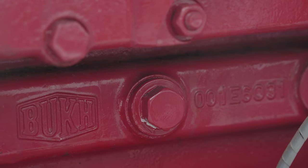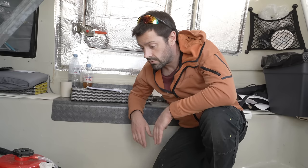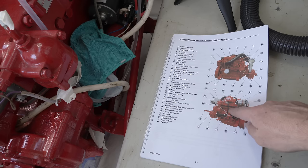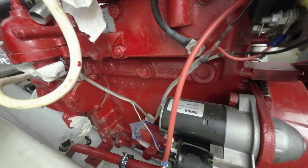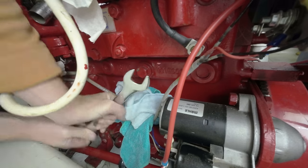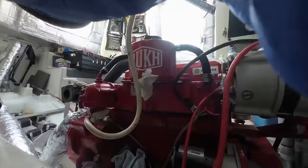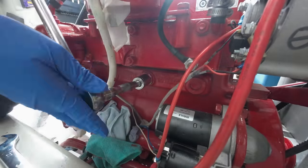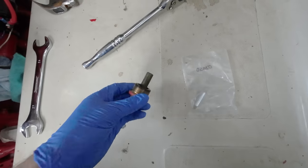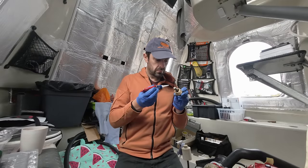There are some large, painted-over bolt heads on the starboard side of Alan's engine. Let's see what sort of state the engine's anode is in — it could be completely gone, or it could be literally as new. I became increasingly certain I didn't want to unbolt the engine and have it fall in half in front of me, so it was worth double-checking that I was aiming for the anode bolt. Once out, and hopefully not releasing another torrent of coolant, I hope to see how Alan's engine's internal corrosion has fared. First attempts were fruitless, and I remembered the last time a spanner and I took on this side of the engine, back in the starter motor swap-out days, I ended up with bloody knuckles. A socket was sent for, and that did the trick. Was the anode corroded away, leaving the steel block to be eaten away at? With a quick wipe clean — practically as new. Still cylindrical and unpitted. Great news. Well done, Alan. I decided to leave the original in place and keep the replacement as a spare.